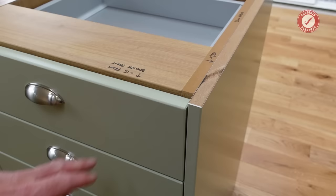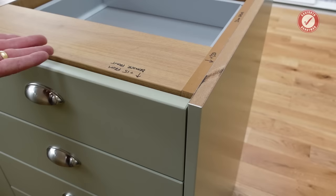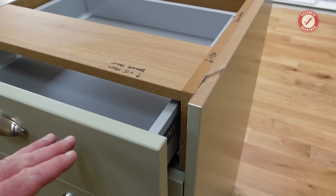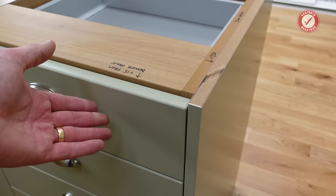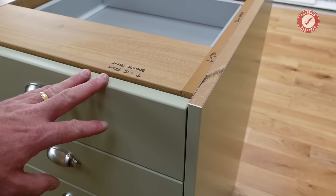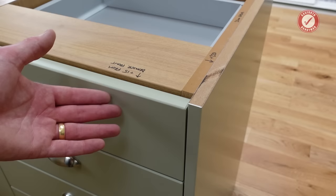Because this is a fully painted kitchen we don't have to worry about foil delaminating over time, which can always be a problem five years down the line. I've seen that on really high-end kitchens where the foil around drawers and door fronts starts to delaminate at the edges, but because this is fully painted and we've got that plastic edge banding on as well, I don't think we're ever going to run into that problem. They do also sell foil-covered drawer and door fronts, so bear that in mind when ordering. One downside of a painted kitchen is that everything is generally made to order, so if you damage something during installation you'll have to wait for a custom-made part.